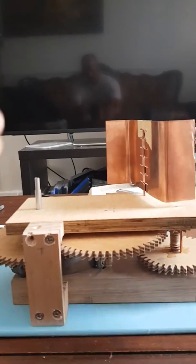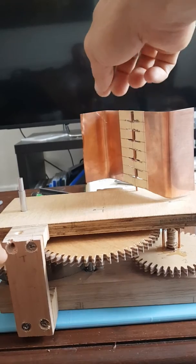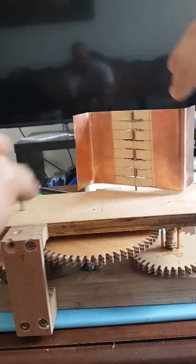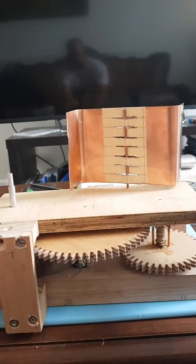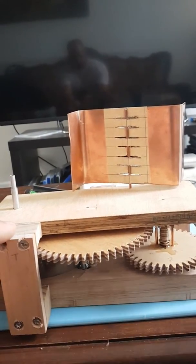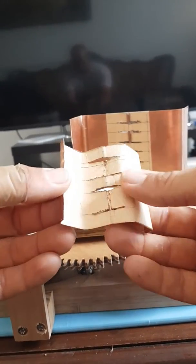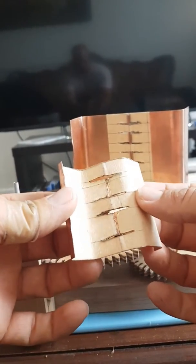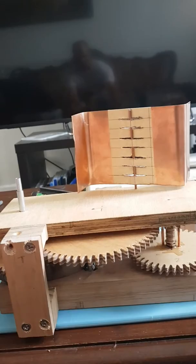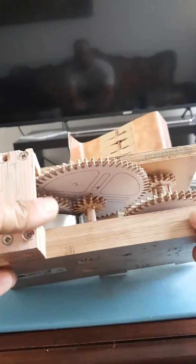As you can see, every time you increase the size of the governor, the greater size creates greater air resistance. I imagine if you actually capped the tops and bottoms to create pockets of air, that would probably reduce the unwind time even more. What I want is to have a fan about this size, so to do that I need to use enough gears with larger ratios.